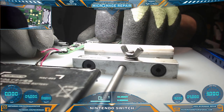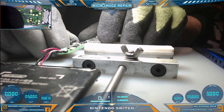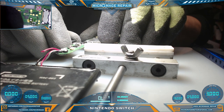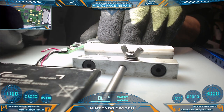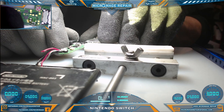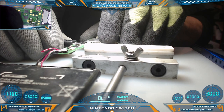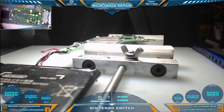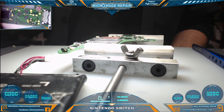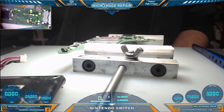We reconnected our battery just to make sure it's not the PSU being fussy. Normal. Switching around — and normal on both sides. Yay! Finally I get to show you one with the diode arrays being a problem. So it was definitely our diode arrays causing the problem — probably the back one. These are non-critical items so I'm not going to replace them, we're just going to leave them off. In later revisions they left them off even though they had population spots; it was a design decision that was great in theory but not in practice, so they went away.